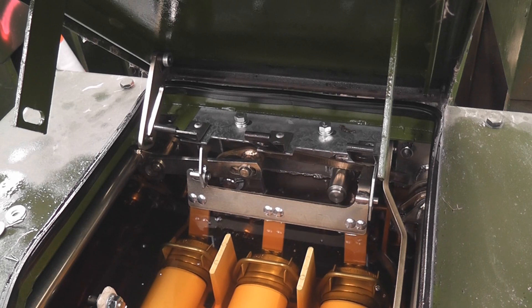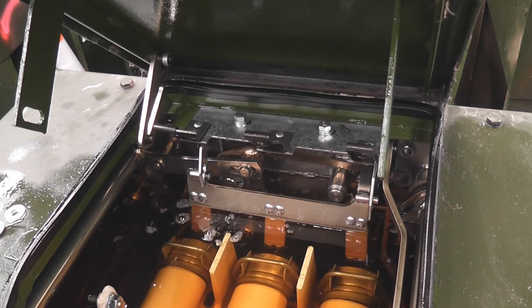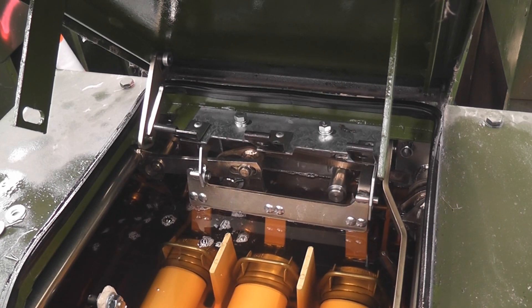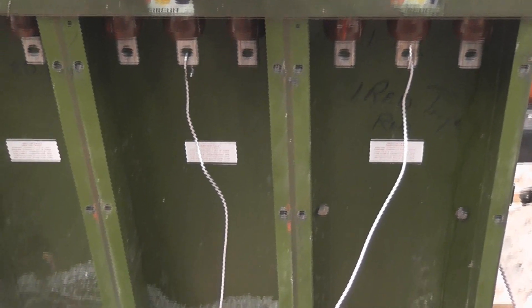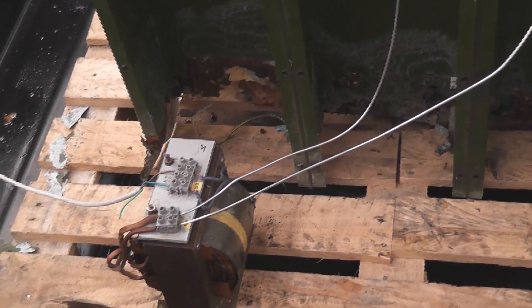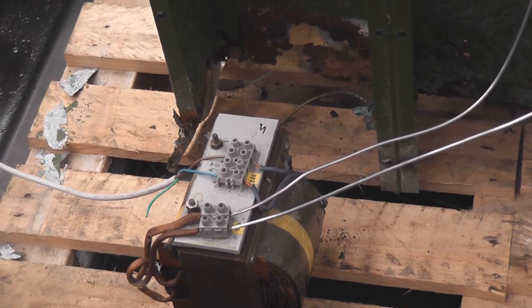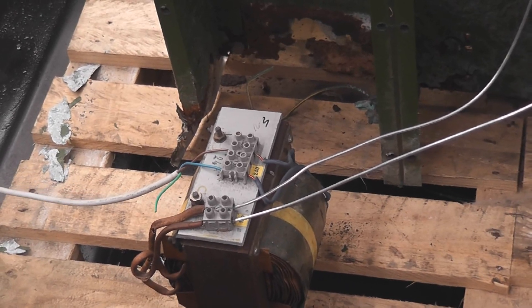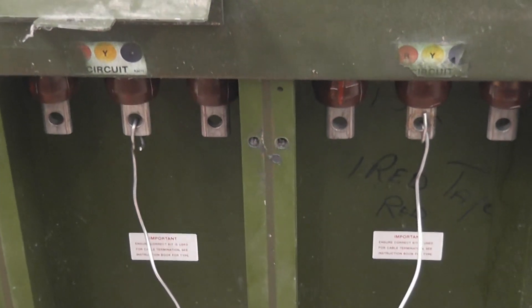Popped another fuse on the yellow phase - open circuit fuse. I will do a better setup one day, but this is just for the principles of how it works. That's 150 volts. The fuse goes open circuit with 11 kV - fuse is open circuit, you've got full voltage. But at only 40 volts there's not enough voltage to trigger the actual striking device in the fuse cartridge.